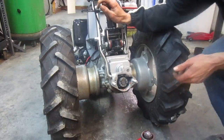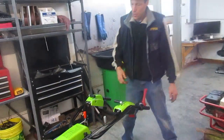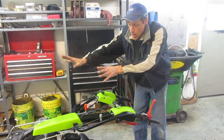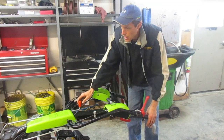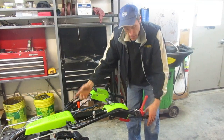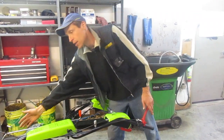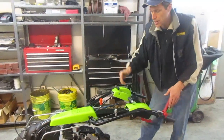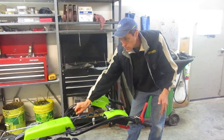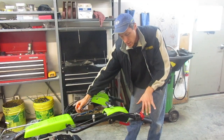The way we're going to do that easily is we're going to use the clutch of the tractor. If you're attempting to engage the PTO — right now we have this tractor in the front PTO mode, so we'd be mounting something like a mower, a chipper shredder, or a snowblower out here — I'd be pulling back on this PTO lever in order to engage the PTO. If the handlebars were on the other side, I'd be pushing, but we think about it as this lever moving toward the engine. If you're attempting to engage the PTO and there's resistance, and it doesn't feel like it wants to go because those teeth are just not lined up properly, you need to get the shaft to turn — use the clutch.